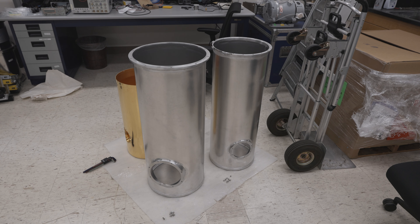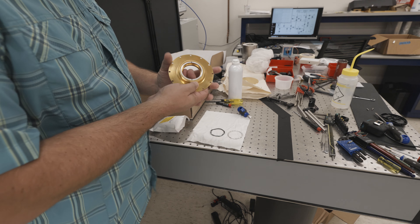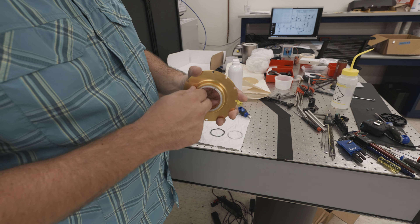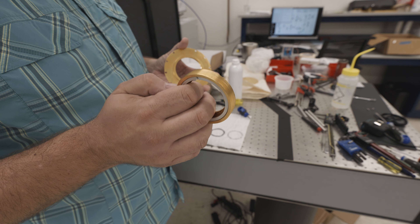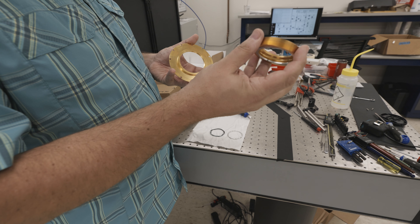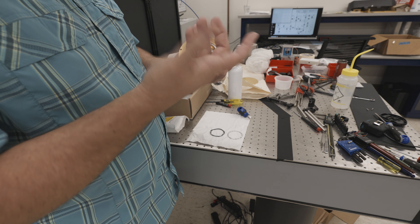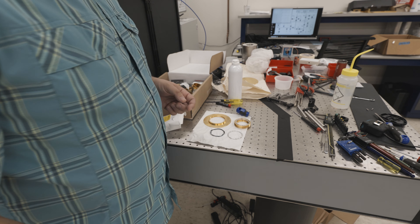This is the annoying one with the Torx. We can either go inside or outside the Torx — I think we need a Torx T10. We have T5 and T15, but not T10. This filter holder is the one I gave to the machine shop, and it fits perfectly. It turns out this one was about 2 thousandths of an inch smaller than the other — maybe a tolerance of plus or minus one thousandth. This one was under by a thousandth, the other was over. When I used this as the guide to make the new one, they ended up being a little undersized, so the other ones, which are bigger, don't fit in. The shop's modifying the plates now. I also just got fingerprints all over this, so I'm going to clean it up.